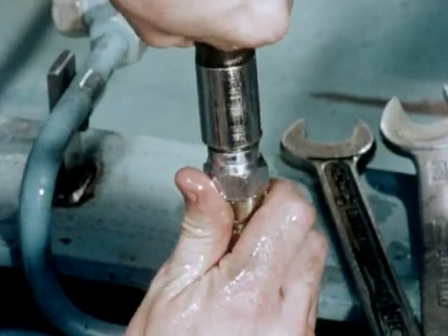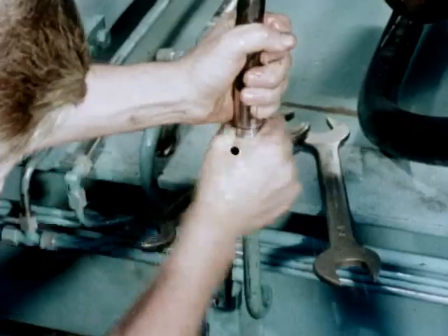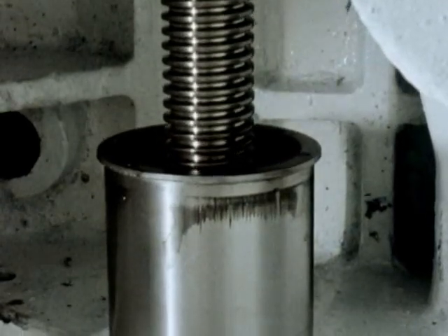Second, as a sealing thread, when you want to make liquid or gas-tight joints. Or thirdly, as a thread when you need to transmit movement, like the translational screw of this milling machine.